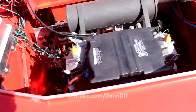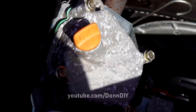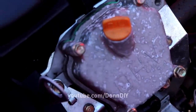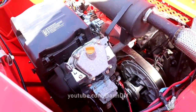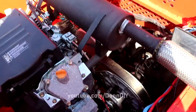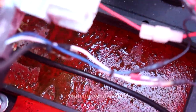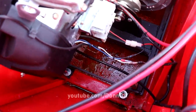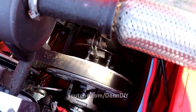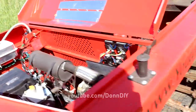Here you can see the engine, a close up from the engine. It's a surface corrosion. The engine spins around. I looked inside, there's no corrosion inside the engine, so this is only surface corrosion. There you can see the water on the bottom. In the future it should be parked tilted, nose up, so it can drain properly and it doesn't rust that way.